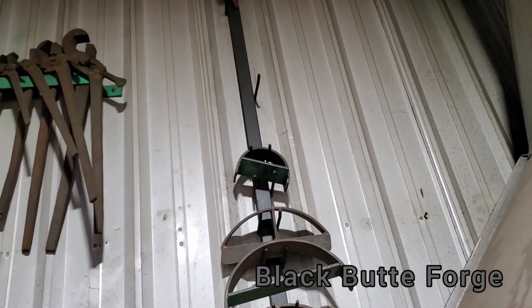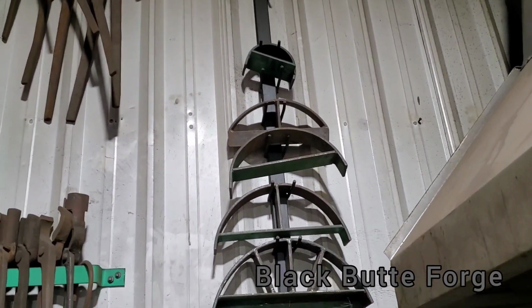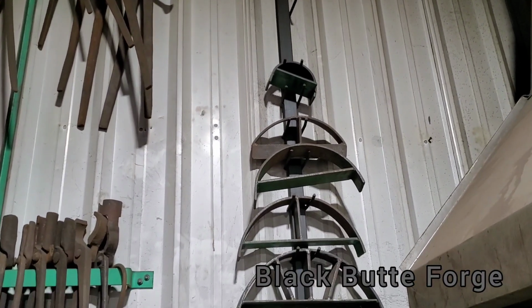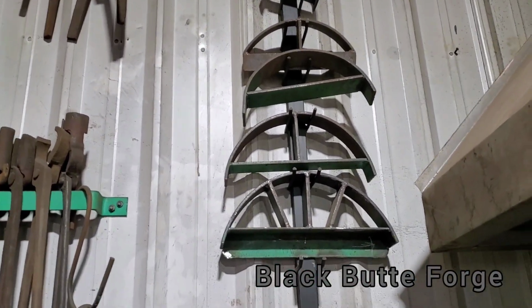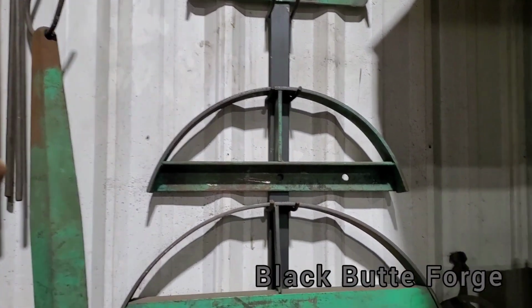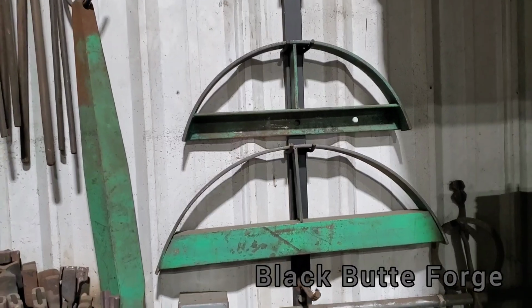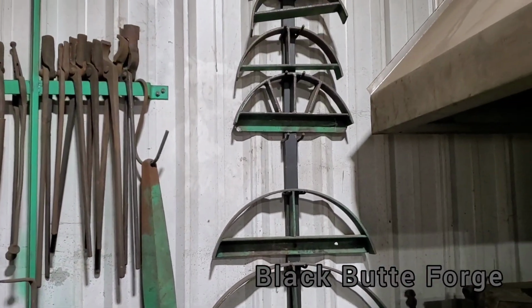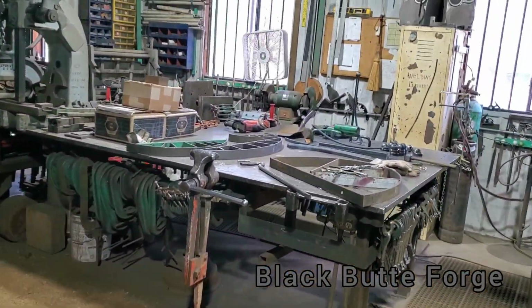Then you put that one in the vise, and I'm missing the next size, but what you'll do is spring another one around it cold, and then weld a brace, whatever it springs open to, etc., etc. And eventually you can see how this one was made off of that one. They just spring open, okay? And you just make a series of these. Once you have a series of these, that allows me to make a series of these, okay?